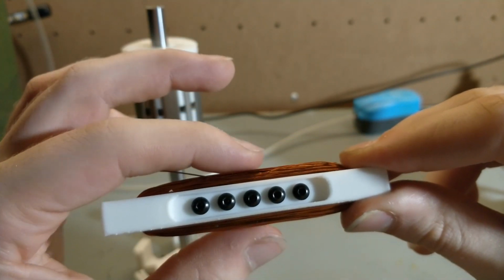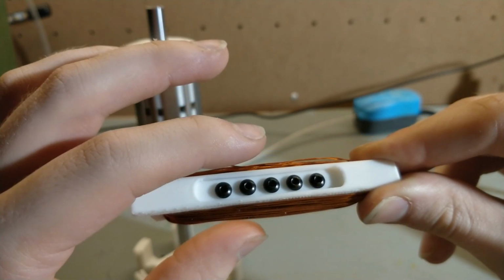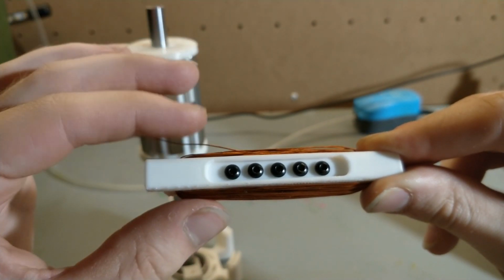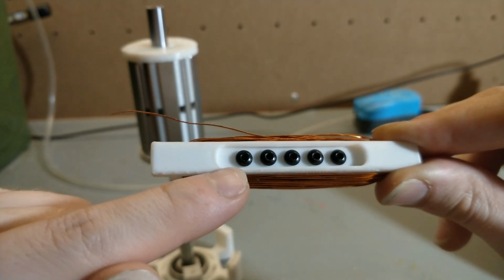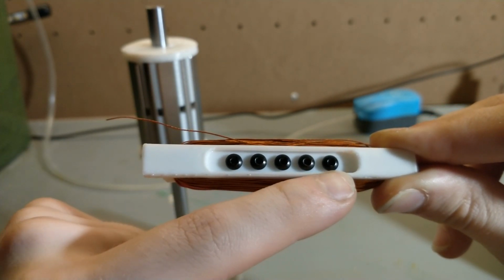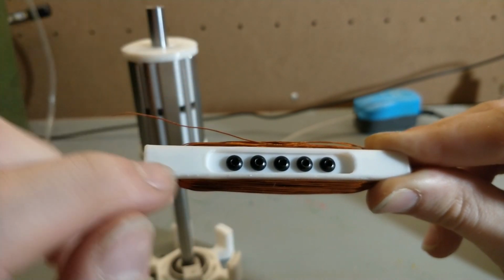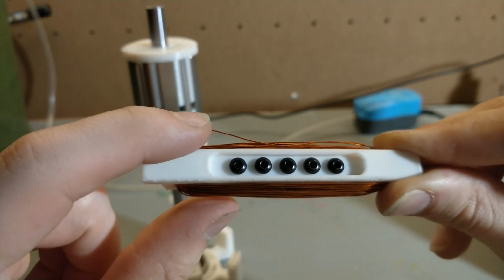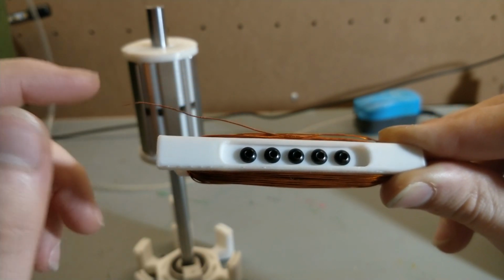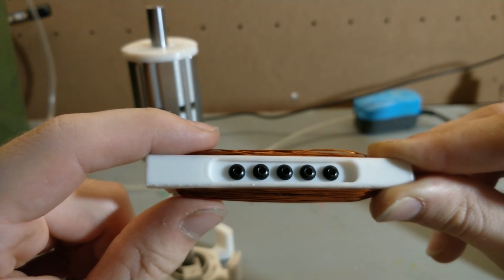This is my second ModuCoil prototype, and it has a couple of improvements over the first. Firstly, when I press down on here, there is very little bounce. I have wound the coil round its holder quite tightly. Secondly, instead of stainless steel, I have opted for carbon steel bolts. They are not austenitic, and they have a much higher iron content, and this makes them much more strongly ferromagnetic than the stainless steel screws I was using in the previous one.